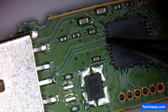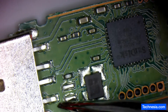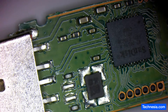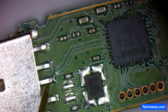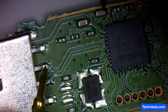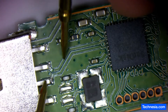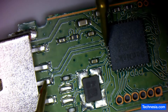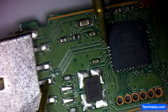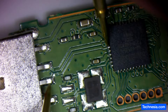I'm going to check the connection on the four USB pins right here. These two are the voltage line and these two are the data line. I'm going to use a multimeter in continuity mode and check the data line first. This one should connect to this pin right here — good connection.